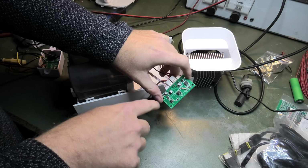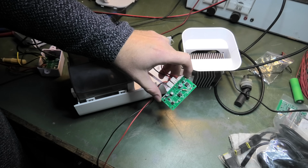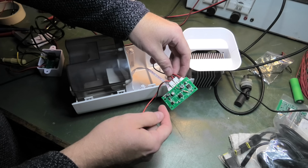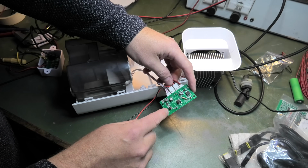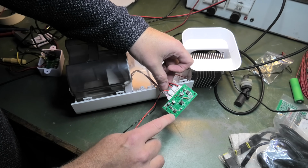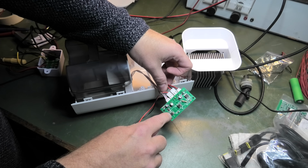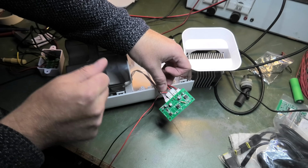I looked at how the things came in, and this little chip here, and I thought maybe it's just an AND OR gate, a digital signal thing, because it has this sensor here, the one with the magnet that feels the water, and if that is okay, and if the power press is okay, then it turns on a signal somewhere to turn on the rest. I followed the signals going in and out of it: one coming from that sensor, one from the button, and one going over to this more beefy stuff over there. So I thought, that's the one.